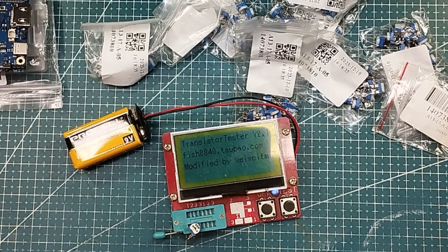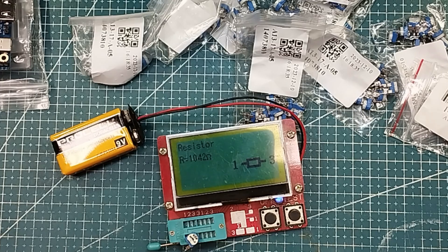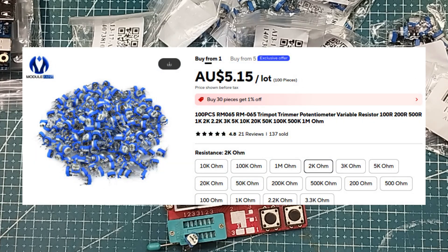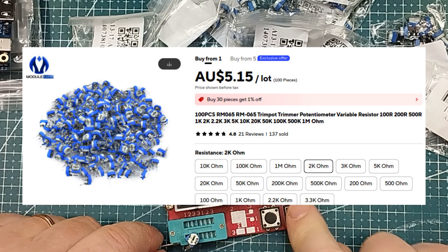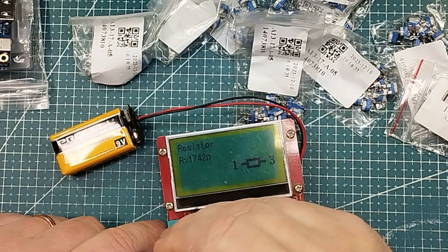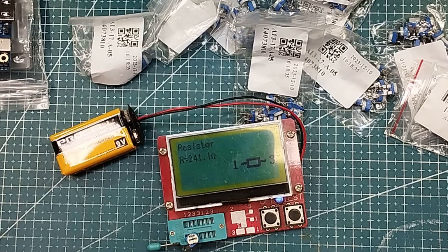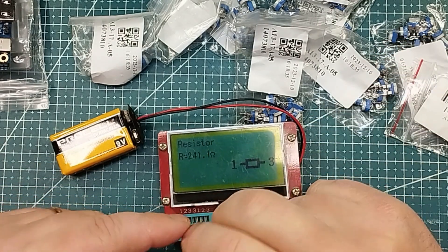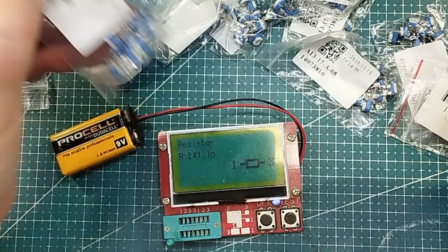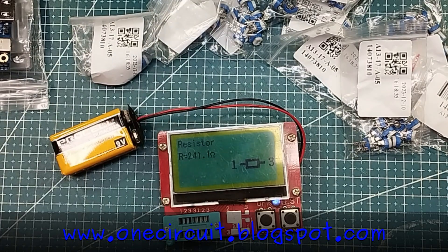So they're usually set in the middle, so I'll be able to tell pretty much straight away what's going on. It does take a moment. So in the middle — I think I was right with 2K, so that's 1K. And if I wind it one way we should see a change. There we go, it's going up towards 2K. And we'll go the other way for a bright light. That LED combo has a fixed resistor in there anyway — 241 — I think I put a 100 ohm resistor in there as a minimum, and then you could wind this one right back and things would still be good. So that's great. That's just a restock — restocking of little pots. Beautiful thing.